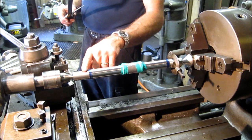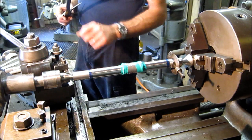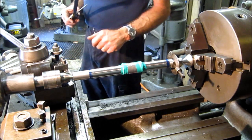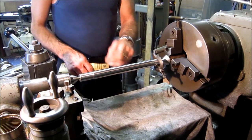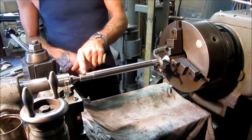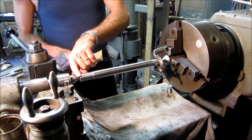We're going to take the last 7 thousandths off and take 75 off both ends. Then we'll polish these and the whole shaft and we're ready to press it together. We've completed both diameters and rolling over the end of the shaft, giving a nice radius.